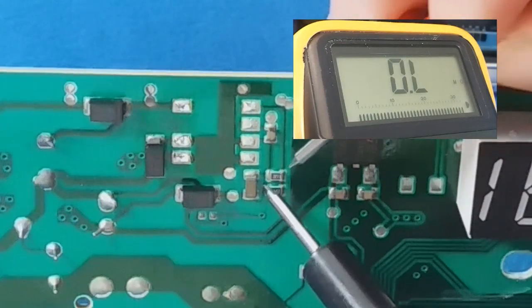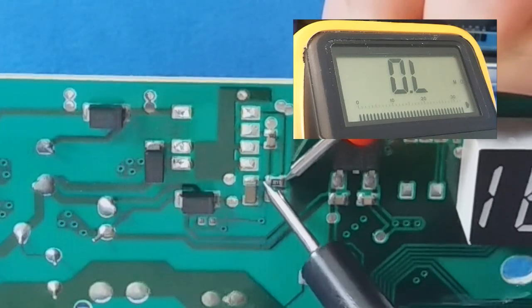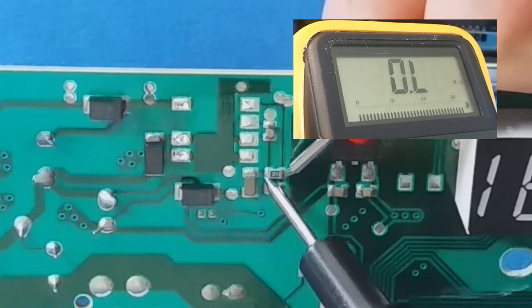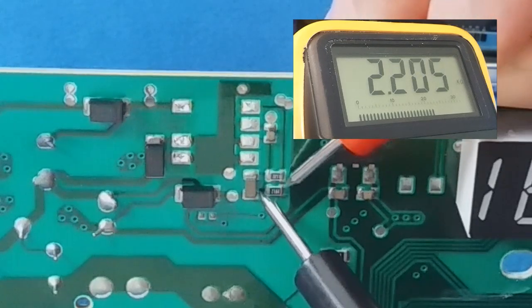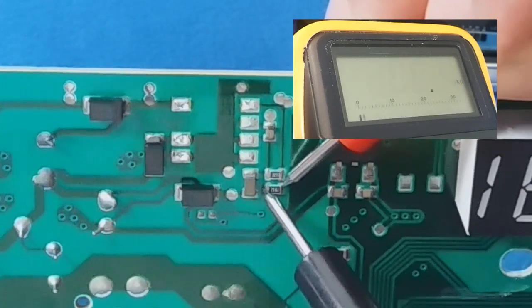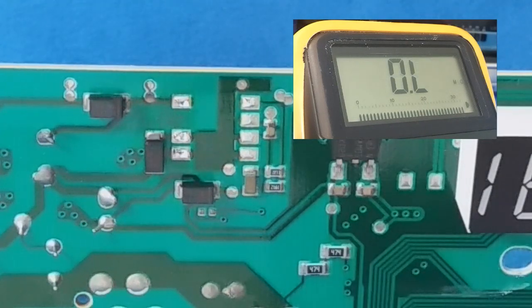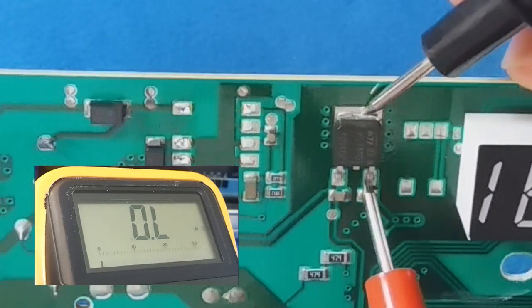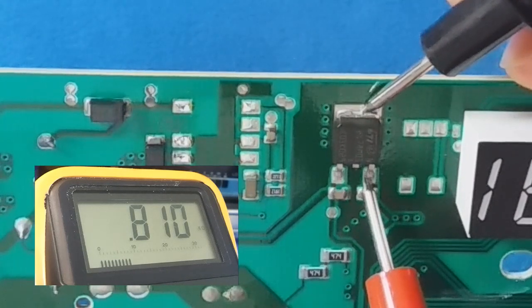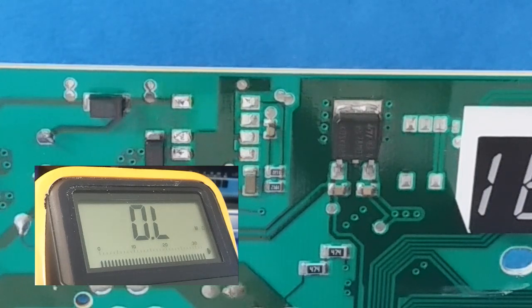In this side, I have resistors. It's a little bit hard to watch through the camera. This resistor is okay. And the other one, it's okay too. Now this is the voltage regulator, 5 volts. I'm doing a measuring of resistance. I want to ensure there is not a short circuit in the other side of the regulator. It's okay. That means all my problems, they are in the first stage of the PCB in the power supply